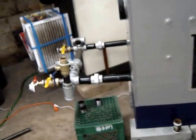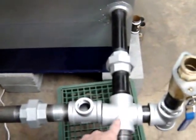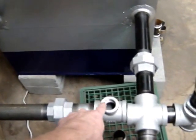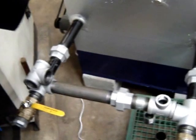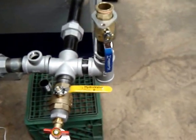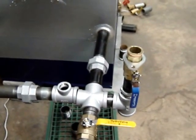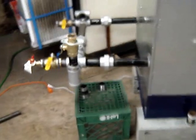Currently concentrating on the crossover pipe in the back. I wanted to go full one and a half inch on the crossover. Got an iron cross here, and a one and a half to one inch T for the boiler bypass to feed into, and hopefully enough unions and valves to actually put it together once I screw the pipe together — that's always the trick. I was thinking of putting a drain with a pump out this end, but I'm just going to do that down at the bottom so I can pump the water out if I need to drain the boiler, because I don't have a floor drain. Got a fairly high ceiling basement and it's no place for water to go.